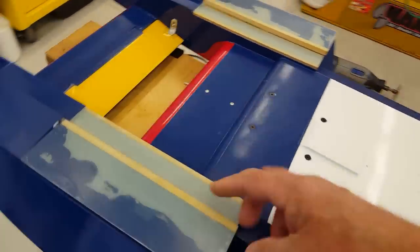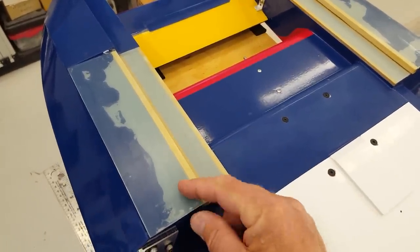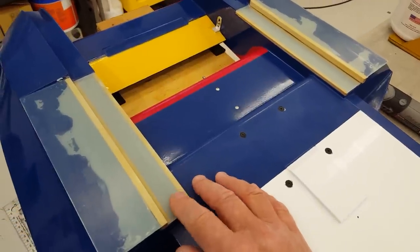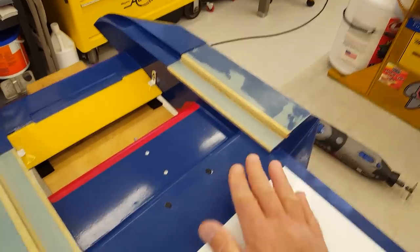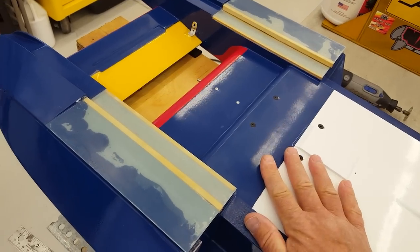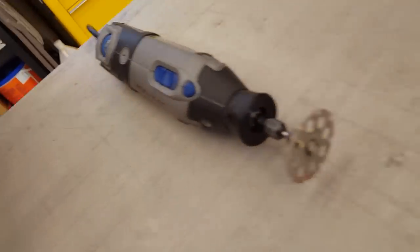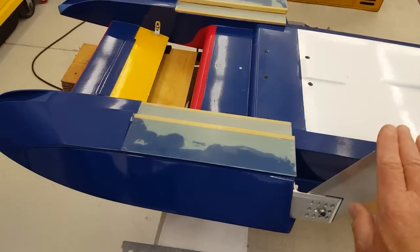So this last race I built some pieces and brought them with me, where I deepened the steps slightly and deepened the pads, widened the pads. I did this in increments — I put these on first and the boat was improved, just mildly improved. Then I widened the pads and deepened them with these two pieces, and presto, the boat worked — not perfectly, not fantastic, not a race-winning boat yet, but it's a step in the right direction for certain.